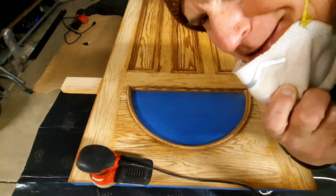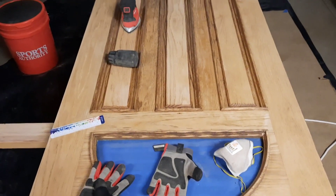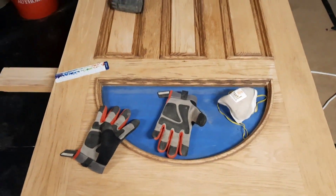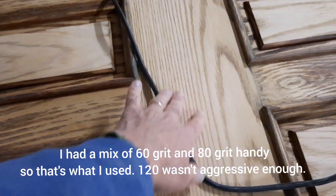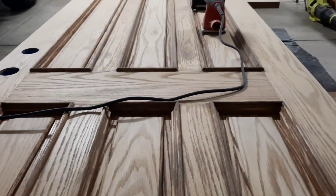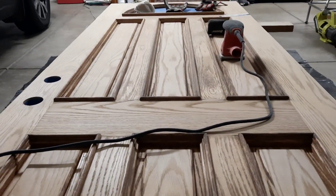That was 15 minutes and we have several hours of sanding to do. After four hours of sanding, the door is looking really good. We've gotten the six panels completed along with the side panels and the top. We did have to reduce the sandpaper grit down to 80 to take off some of the sun damage on the lower part of the door. I'm probably going to have to sand the areas between the panels by hand because I need something about two inches wide. On the molding, these areas are still pretty darkened — that's going to take a lot of manual work.